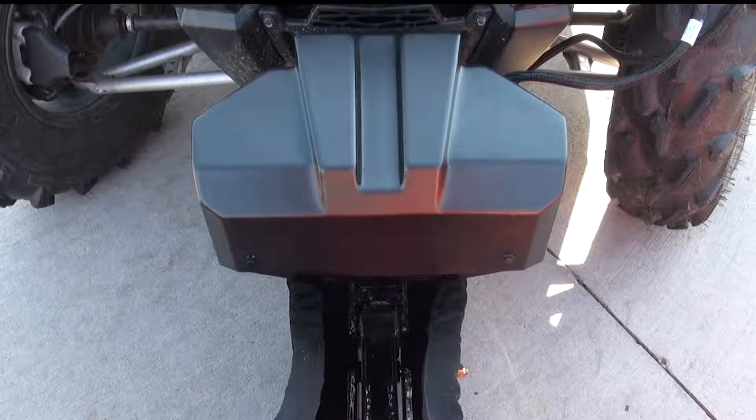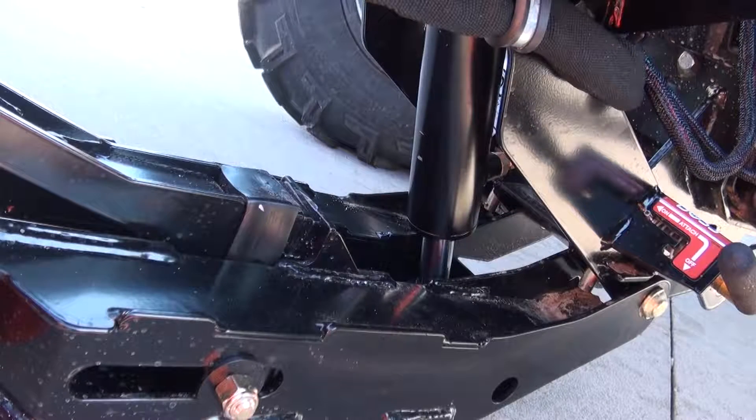To give this plow life, we utilize the Boss high-performance hydraulic package in a fully enclosed compartment, protecting it from the elements. Several of the components we use in this plow are common amongst other Boss products, which minimizes the amount of specific parts you may need if repairs are necessary. Gone are the days of manually lifting or winching the plow into the raised position. The Boss 5.6 VXT utilizes a hydraulic lift cylinder to raise, bringing it up to a full 30-degree lift height, making snow stacking a breeze.